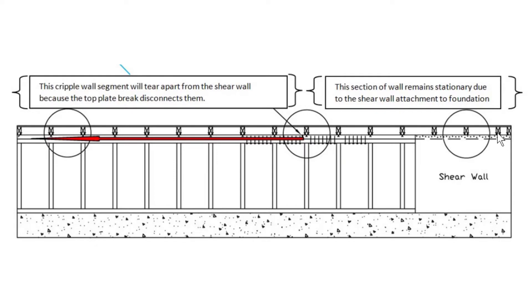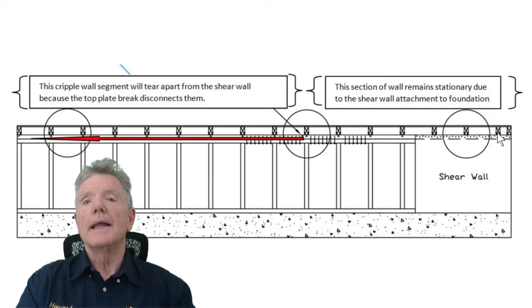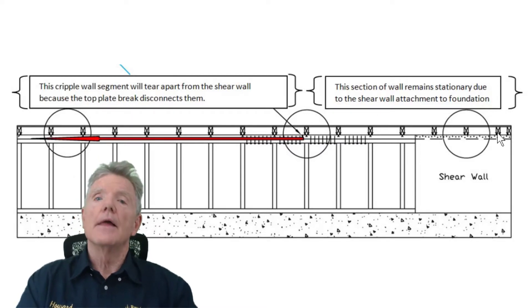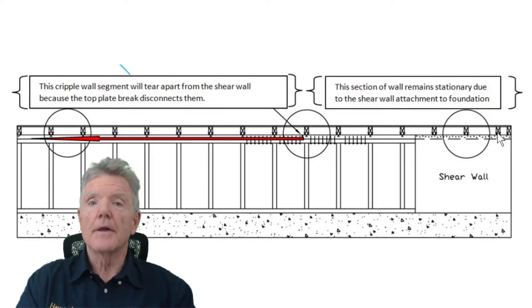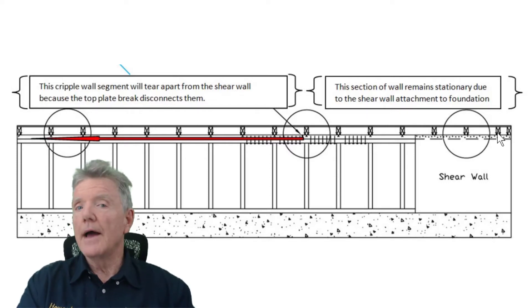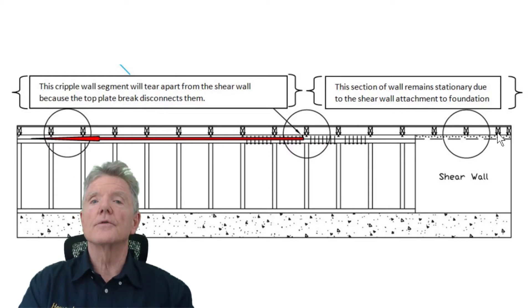You see why this connection is so critical. If you don't do this, a large part of your house may not be protected because it's not attached to a shear wall. The shear wall is designed to anchor the floor of the house to the foundation. If you don't make these connections, a certain part — maybe a big part — of the house will be disconnected from the foundation, and your retrofit will not work as intended. No matter how many breaks you have, you need to connect all of them so that all the force goes into the shear walls.